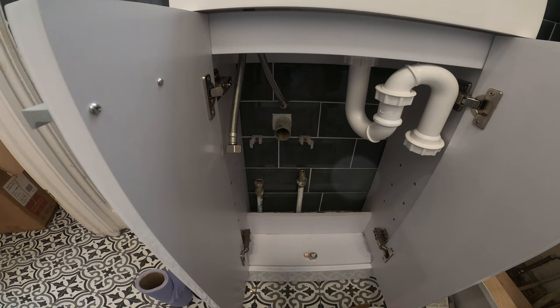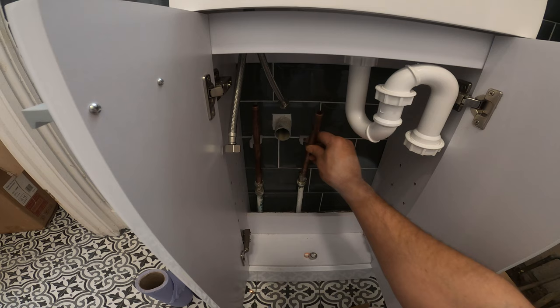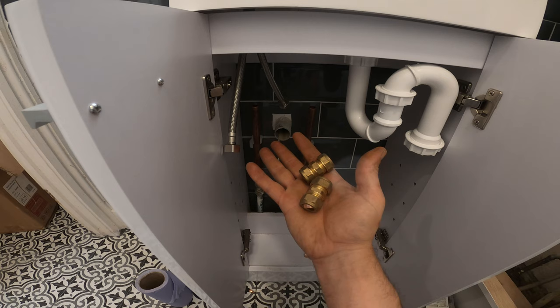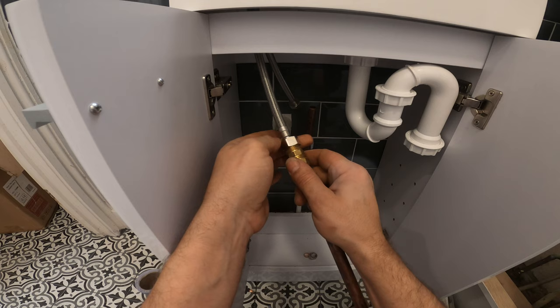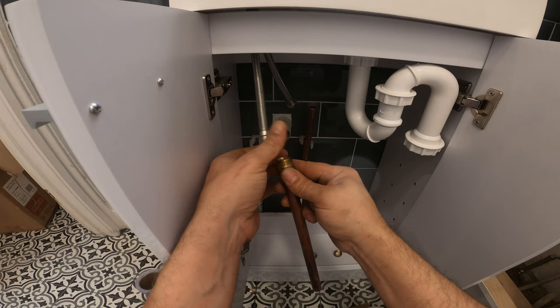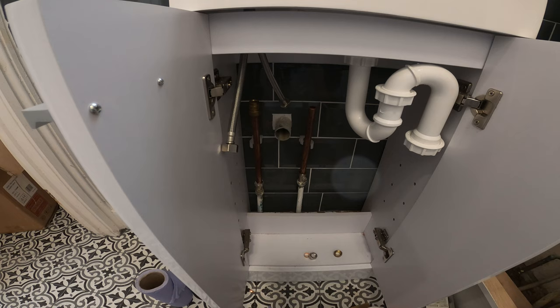But I'm going to do it differently — a little bit more complicated. I'm going to put some copper pipes inside here and make it a little bit longer. For that I will need some compressions as well, because those are going to come right on top. I'm just going to take this one out and then connect straight into the flexible like that. I think this way is going to be a little bit more tidy. I'm going to tighten these up and tighten it also on my Polofix shutoff valve, and then I'm just going to connect the flexibles.